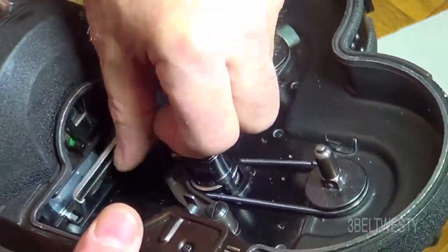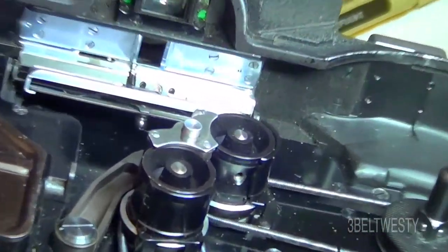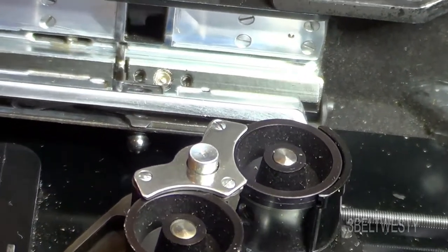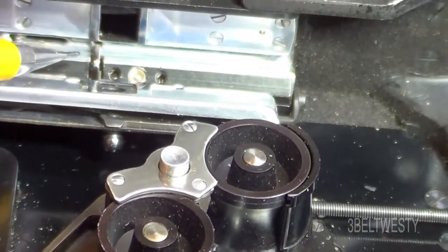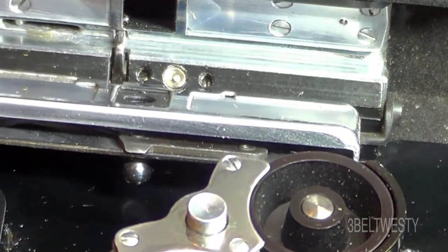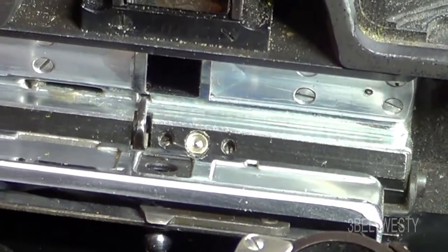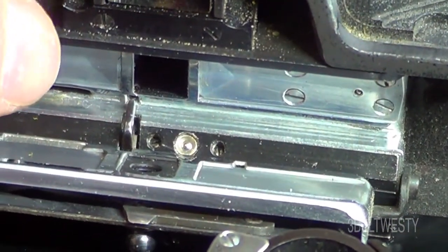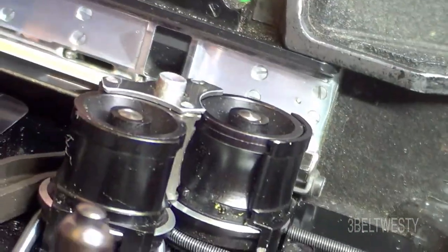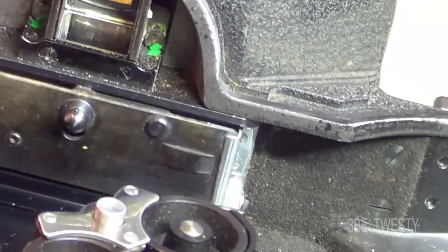This has got a registration pin, which makes the imagery rock-solid — there's a pin right there. If I revolve this around you can see the pin. This pin here goes into the film sprocket hole — this is what advances it. You've got a piece that's going through and moving the film down, but when it's doing the exposure the film is held absolutely still because you've got a pin that goes through the sprocket hole. When I've got all this exposed like this you've got all the optics exposed, so that's not the best thing to be doing — I'm just doing this for the video.